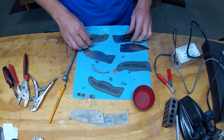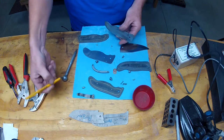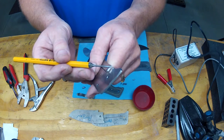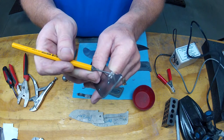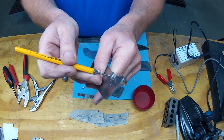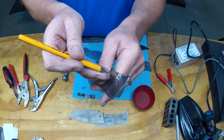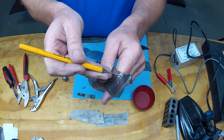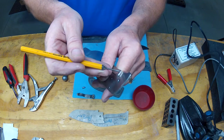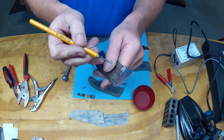What I want to do now is carbidize here on the lock face. We're going to deposit a layer of tungsten carbide using a BB carbidizer. That's going to add a thou to three or four thou there. You're not going to save a knife probably using a carbidizer — I know a lot of guys thought that initially when these started taking off.